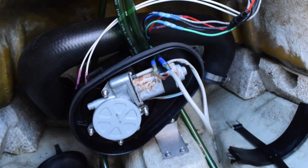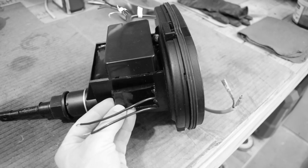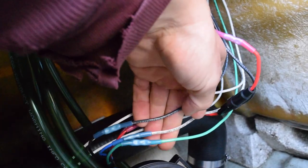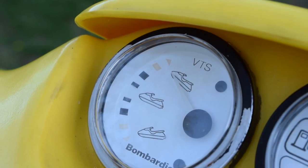As my grandfather used to say, a micro goblin penis is nothing to be ashamed of. Remember that trim fix module I bought? I spliced it into the original VTS wiring harness — power wires, switch wires, sensor wires, motor wires. Simple as that. To get the trim gauge working, I ran the trim up to its hard stop, slapped some glue on the sensor, then slid it around on the side of the old VTS enclosure until the gauge registered correctly.